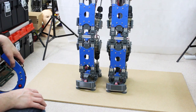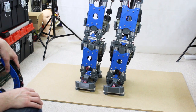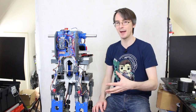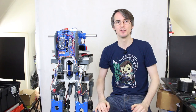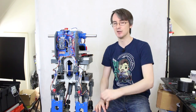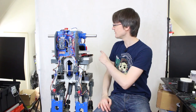I've put some grease on the lead screws so they're not squeaky, and put fresh batteries in — I still need to do something about battery monitoring and power management. The legs are operating independently from a stability standpoint: they both have their own IMUs driving their angles. The motors run at similar speeds, which is why it moves side to side uniformly. Nothing ties them together yet — that's where the third IMU comes in to provide overall stability.